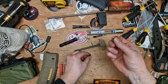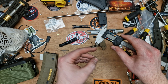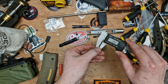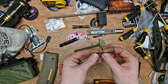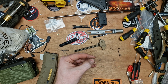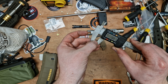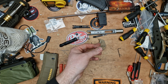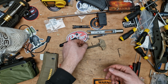And we're basically just going to tap this valve and put an adjustable grub screw in there. And I can't tell you what grub screws you need to use. I think these are M3 grub screws. I just found a couple of them literally randomly on the bench. So the outside diameter is 2.93, so it's an M3 screw. I believe they're a 1.5mm Allen key adjustment, which yes they are. Doesn't really matter on the length, the length of the ones that I've used, they're roughly 7.8mm long. But again, I'm not going for a certain size. I literally just found a couple. I think the other one that I used was slightly longer. And that's what we're going to use.